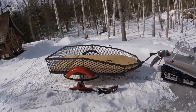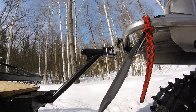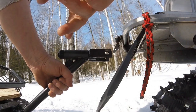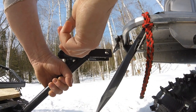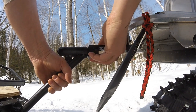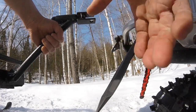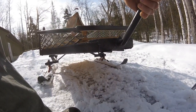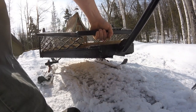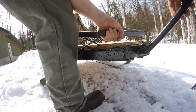The hitch has been made to swivel — it's a three-quarter inch bolt inside a piece of pipe inside another piece of pipe. It's really sturdy. I'm going to grind these corners down. It swivels and hooks up here, so you've got plenty of play. I left this section open so you can hold on to it and put your knee on it to move it around while working with your other hand up here to hook it up — that makes it really handy.